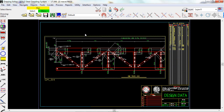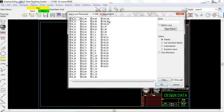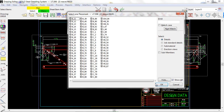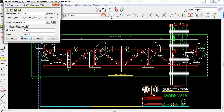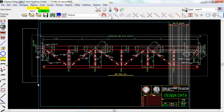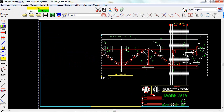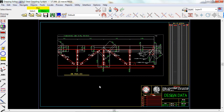To create the B sheet for the right hand side of this truss, we simply use save reuse, type in our next drawing name, and load the drawing again. We're not going to list the material and bolt on the bill of material so we don't double up purchasing information. We reduce the size of the viewport, slide it to the middle of the detail sheet, save the drawing, and we're ready to print this out.